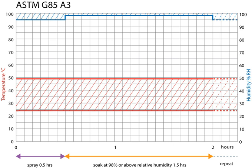Variations to the salt spray test solutions depend upon the materials to be tested. The most common test for steel-based materials is the neutral salt spray test, often abbreviated to NSS, which reflects the fact that this type of test solution is prepared to a neutral pH of 6.5 to 7.2. Results are represented generally as testing hours in NSS without appearance of corrosion products, e.g., 720H in NSS according to ISO 9227.